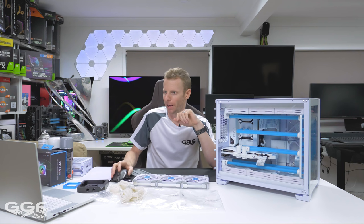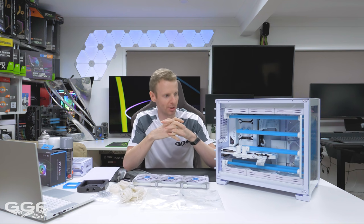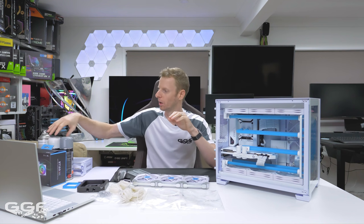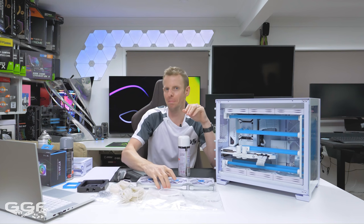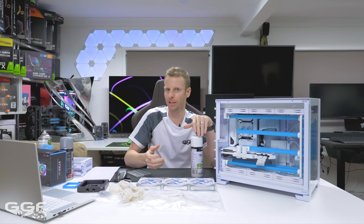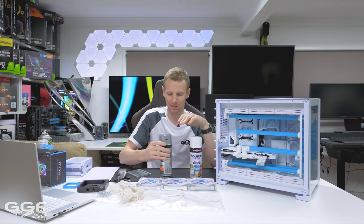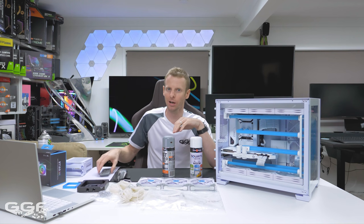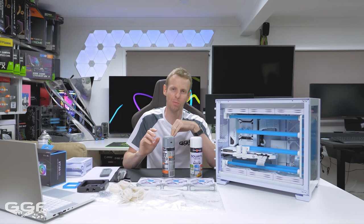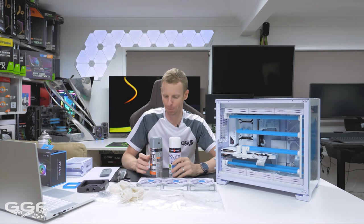So let's jump into the painting process. Mainly when I do my painting process, I always stick to a matte color. I never really venture into gloss. Gloss will show a lot of, not really marks, but slight defects. Now when saying that, I don't mean my work is that bad to have defects. It just makes things a lot easier when you're painting in matte. You don't get reflections. That's why things like your ceilings and all that, they're all matte. They are much easier on the eye and I think matte is easier to paint.